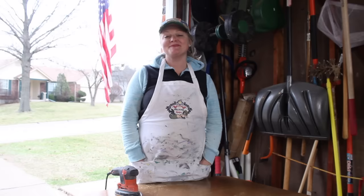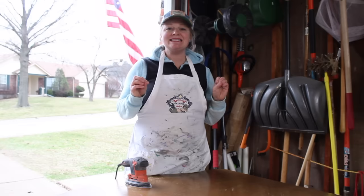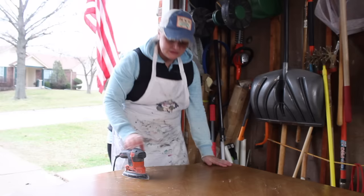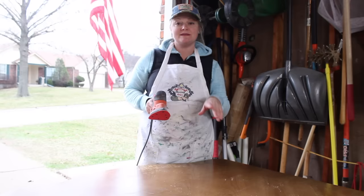It's time to start talking about prepping the table — that's step one. Step one is sanding the old finish. When I say sanding, I'm not talking about sanding the entire finish off — it's just sanding and getting all of the old dirt, grime, and years of buildup off. I wanted to point out something happening on this table: a little bit of the original finish is kind of flaking off in areas and it's kind of a rough feel. So I'm going to sand a little bit more in those areas, then clean and prep the space for painting.